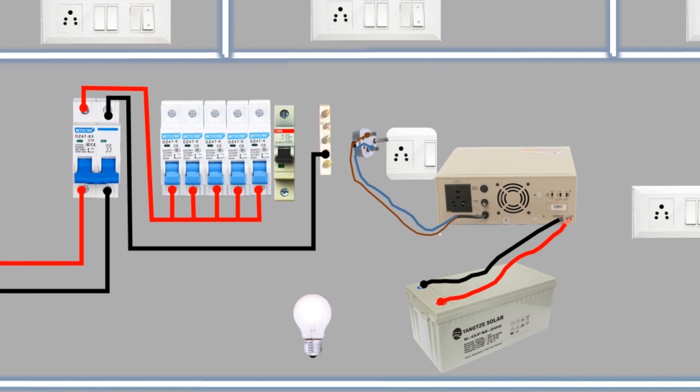The phase wire of the inverter connects to the main supply wire through a relay installed inside the inverter. This ensures that when the supply is available, the main supply phase wire will be available in the inverter supply phase wire. To obtain supply from the inverter, we will use a three-pin plug top. In this wiring, we will only use one wire — the phase wire — and the neutral wire of the normal wiring will be used as the inverter neutral. We will connect one wire to the right side of the plug top and route it to the remaining MCB in the distribution board. The plug top will connect to the socket of the inverter, and the entire switchboard inverter supply will be controlled by this MCB.